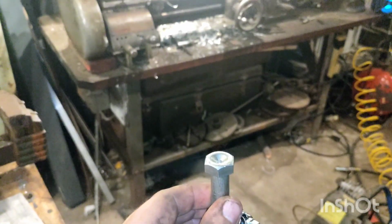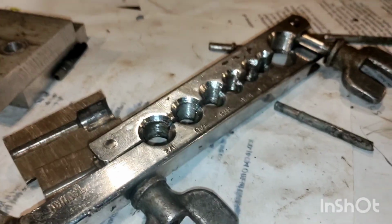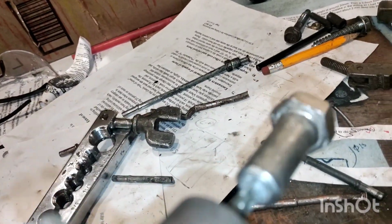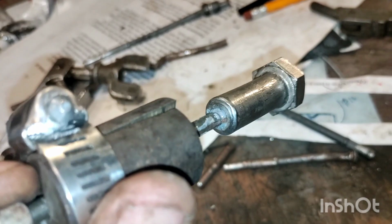Now once this is done, take your plunger, plunge that right on top, and usually it'd be actually better to use a hydraulic press for this, but I like to just hammer it down, it's easier. Right, my brake flare holder didn't want to work properly, so I just shoved the line in a vise. It's a broken line anyway. But you will end up with something that looks like that.